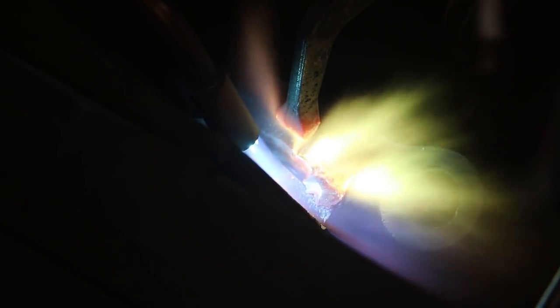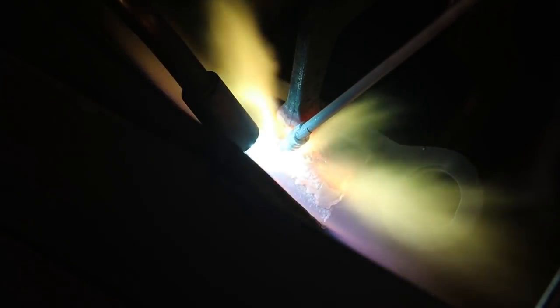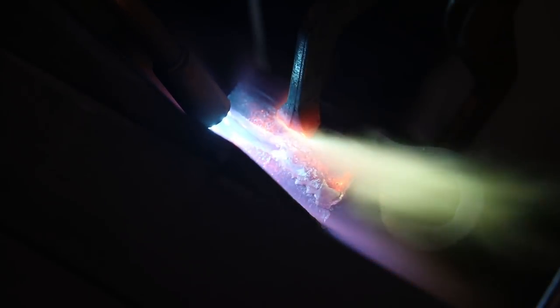As we go across here, you can see I'm starting to lay some braze in there. I'm using a flux brazing rod — it's pre-fluxed — and we're just letting it flow through and melting that metal down. One little trick when brazing: I really don't like to put the torch directly onto the brazing rod. I'm soaking the torch into the metal. You want the metal to be hot enough to melt the brazing rod, not just hit it with the torch. If you hit the rod directly, you don't get a good fusion to your metal. It's a little tricky in tight quarters but that's what I'm aiming for.